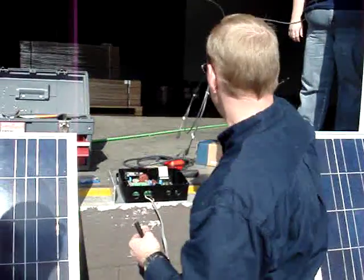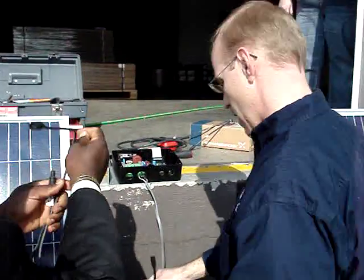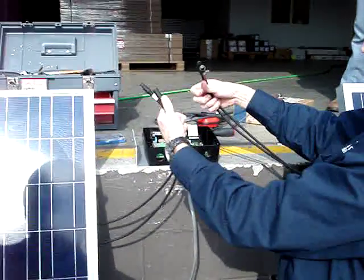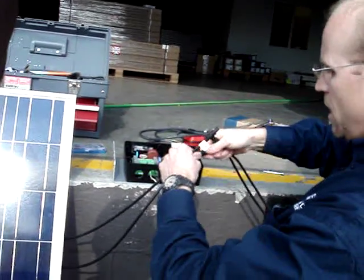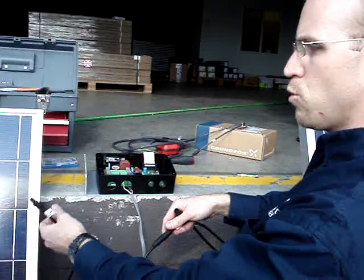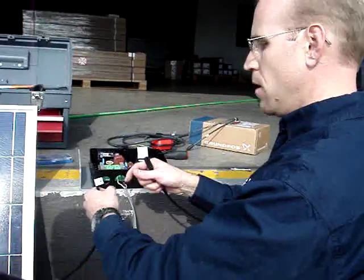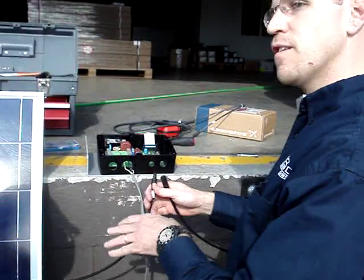So you've gotten this, you've cut it in half. Now you've got two pieces. We've got our connecting cables here coming off of each panel. We're going to take one of them — positive to negative. It's our series connection. We now just took two 24-volt panels and turned it into 48 volts. Actually, these panels operate at more like 35 volts, so we really have now 70 volts.